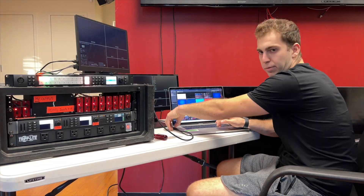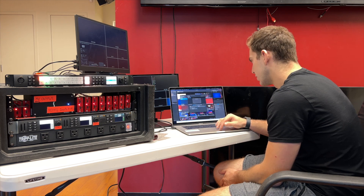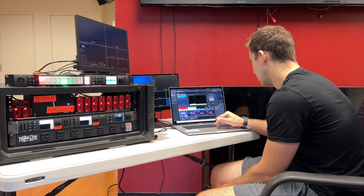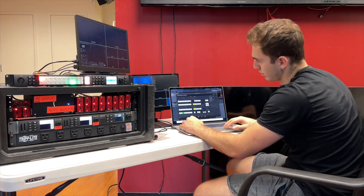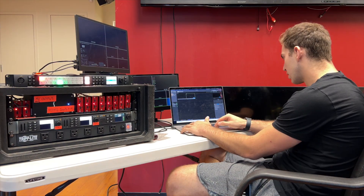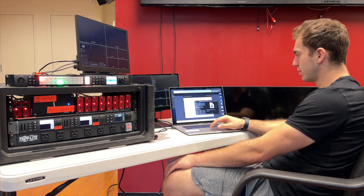Every time I'm in ProPresenter and I plug the DeckLink in, it never recognizes and snaps to where I want it to be. I'm having to switch which port I'm using — figuring out which one is screen one and which is screen two, activating key and fill, and it went to the wrong port. I end up spending maybe 10 minutes or more just finagling around with which port is doing what. If you're trying to hand this off to someone, that's going to be detrimental. So if you're using ProPresenter and a DeckLink card, just make sure you know what you're doing and can troubleshoot when you boot it up.